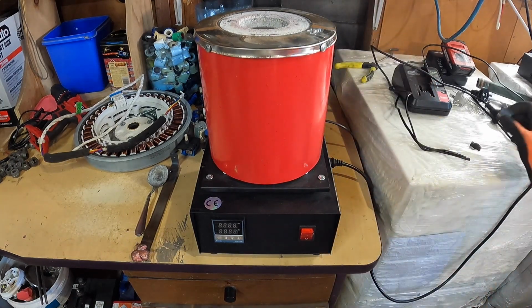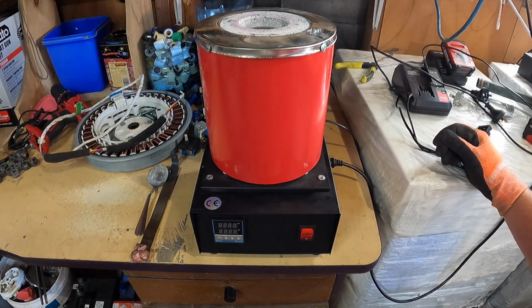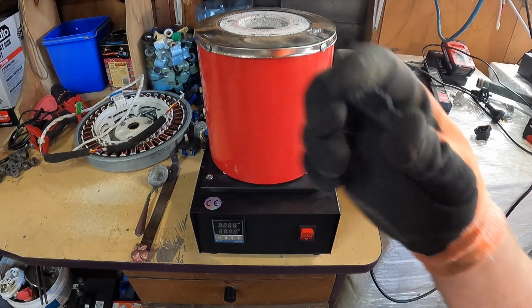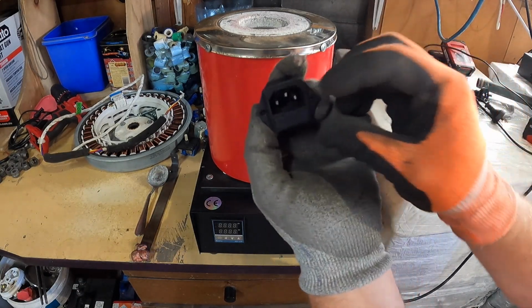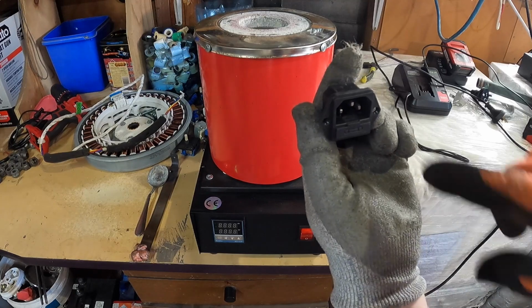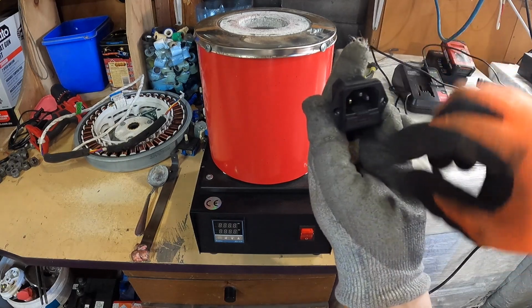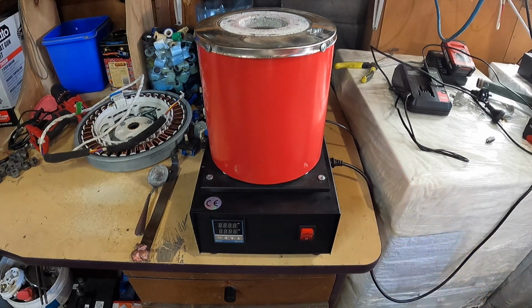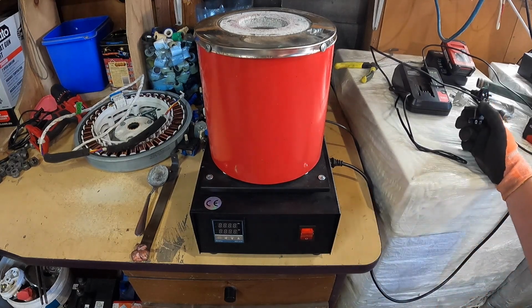And so that was the second time I used it, after I'd warmed it up 3 times to break the crucible in. And there's the fuse holder here, and as you can see, that's all melted and everything like that, and that sat inside. That probably won't fit now, but it sat inside like that. So it started to melt the bottom of the terminals coming into the fuse, after it went through the fuse and back out into the circuit. It started to melt this point here, and because smoke was coming out of the vents at the side, I thought something was melting and going to short out inside, but nothing happened.